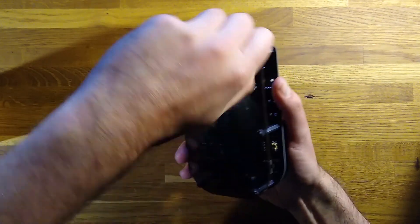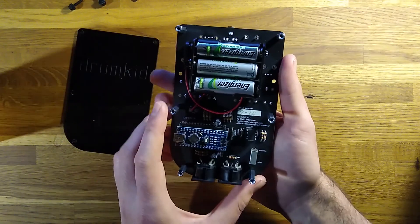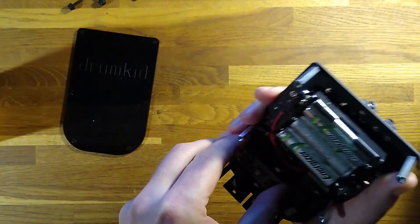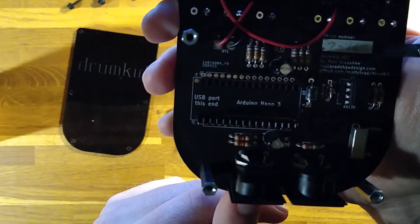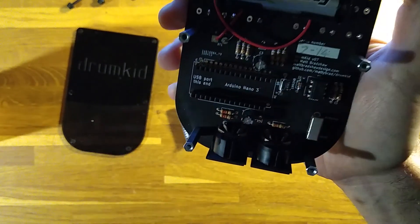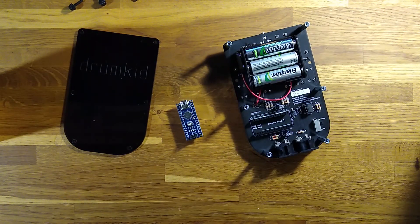Finally, if you're into electronics, Drumkid's hardware is also designed to be customisable and hackable. You can remove the backplate to gain access to the electronics inside. It's a pretty simple design, based around an Arduino Nano compatible microcontroller. To enable people to add their own features, like extra buttons, knobs or LEDs, I've added breakout pins on either side of the microcontroller headers. You can either solder additional headers here, or just solder wires directly into the holes. I'm planning to do a dedicated video showing various features you can add to Drumkid, hopefully including Eurorack compatibility.